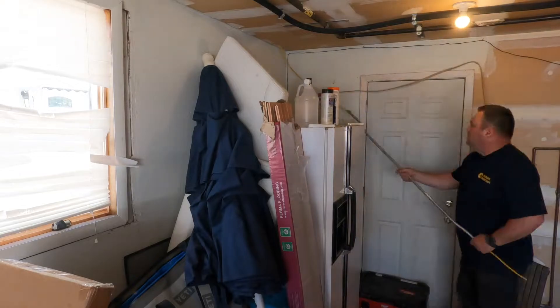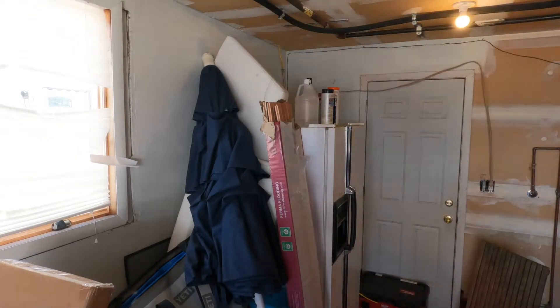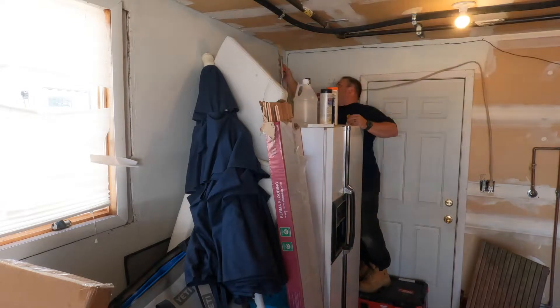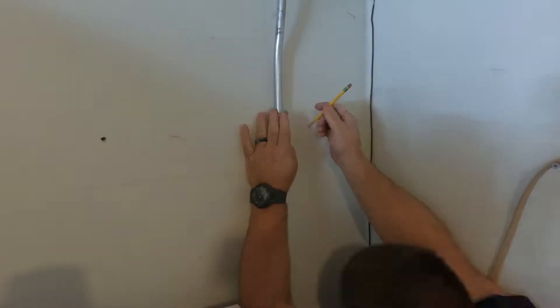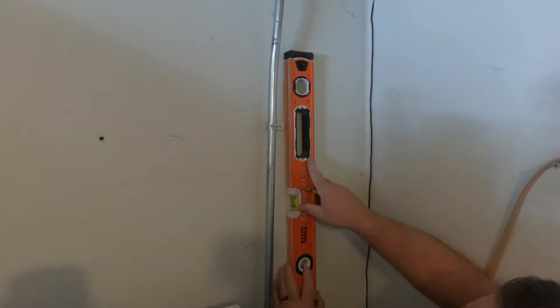On the end at the ceiling, we put what's known as a from-to connector — it's a half-inch EMT connector on one end, and on the top it's a Romex strap connector to secure the wire. That's what the code is looking for.